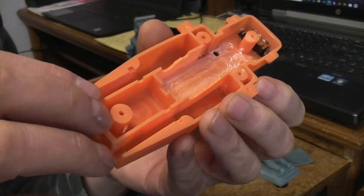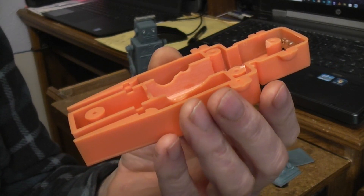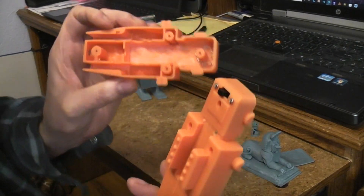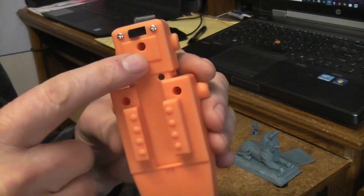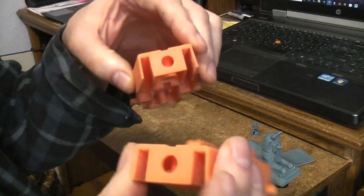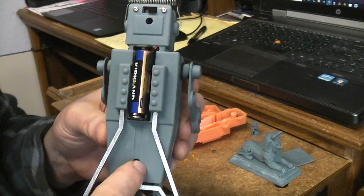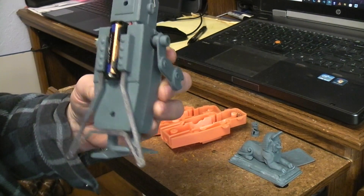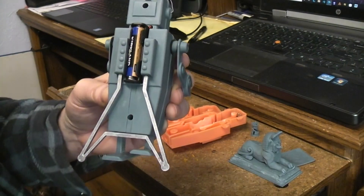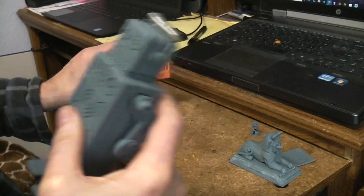I only added about five percent — so 0.5mm in height or something — for what I figured I'd be losing. This one's waiting for some parts so I can assemble and test it. This one has four screw mounting hole positions, and I added holes in the bottom between the legs for draining resin out when it's on the build plate. Initially I only had the bottom and top screw holes — just two — so I ended up adding two more near the arms, since the arms have to screw in and the body naturally wants to separate.